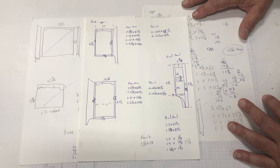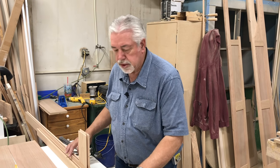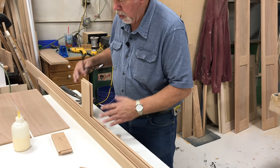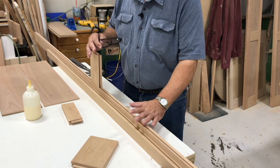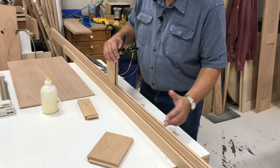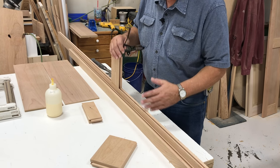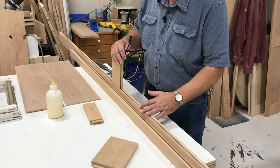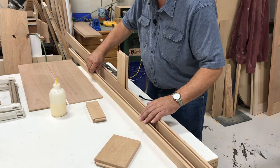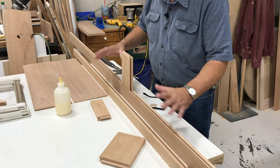When we get all done, we're going to go to the office, install the cabinet, and show you what it all ended up looking like. The first thing we're going to do is assemble the end panel. It's a two-panel end panel because it's so tall, and we're going to do it just table saw shaker style. Watch my video on table saw shaker style doors to see how I laid it out and determined my stiles and rails and grooves. We're going to assemble that now, table saw shaker style, and that will incorporate our corbel at the end. You'll notice one of my stiles is longer than the other — this is my face stile, this is my wall stile — and the corbel is going to be down here at the end.